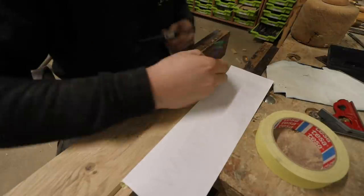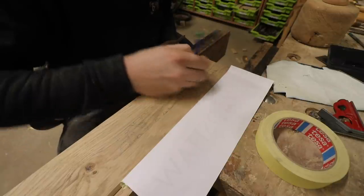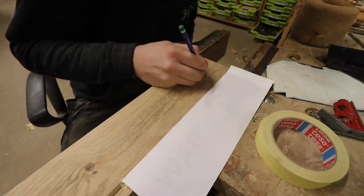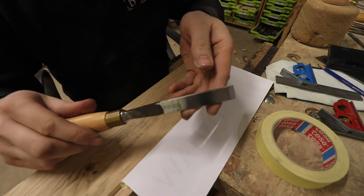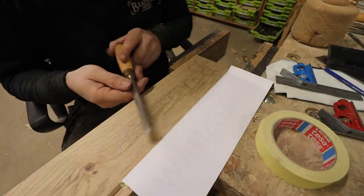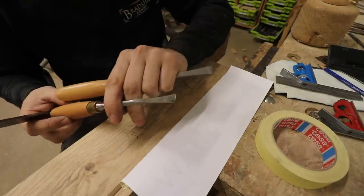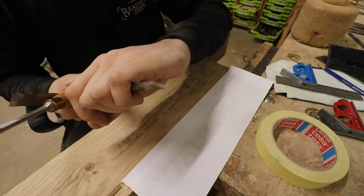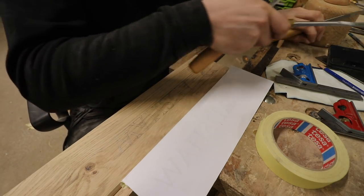So you can draw a line around the centre of everything. And that's your stop line. I think I just used to eyeball it. My letter carving isn't perfect. Got the little Ashley Isles chisels. Basically all you need is a couple of straight ones. These are the most important ones. They're the fishtail chisels. So just a little fishtail curve and a fishtail flat. And you can pretty much carve anything with them. That's sort of what I go to the most.